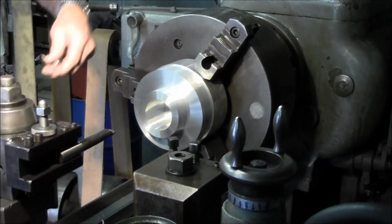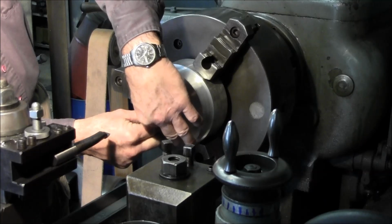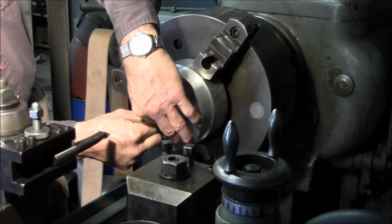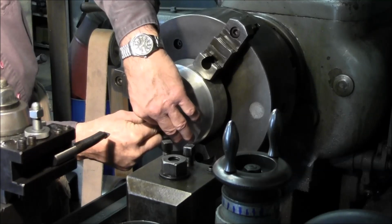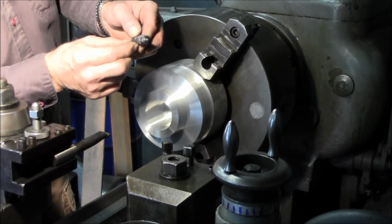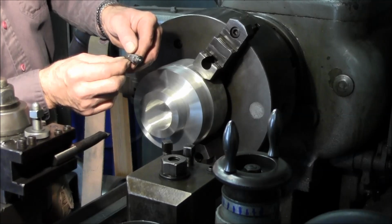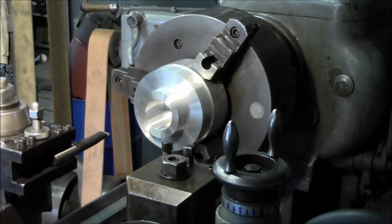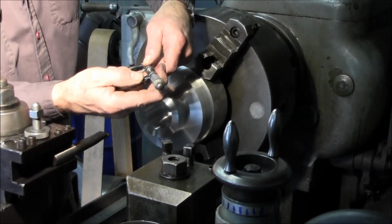We're gonna use our inside micrometers this time here, and see what we got, and we'll verify it with our snap gauges again. And this bore doesn't have to be this close. We're just kind of running it through, okay? On this dial here, I'm reading 2 inches, 187. If anything, it might be 186 and 9.5 tenths or so.